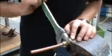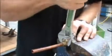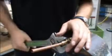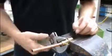It's quite a small nut so you don't need it too hugely tight. If you use too big a spanner or crescent — a 12-inch crescent or larger — that's actually really too big. You don't have enough feel, and you've got so much leverage that you could easily over-tighten the nut. So try and use a crescent the right size: if it's a big nut you need a bigger crescent, if it's a small nut, use a small one.